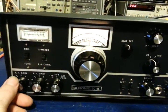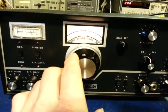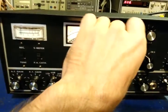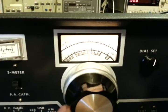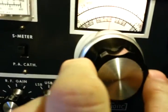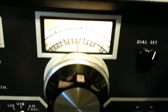You hear that? Hard to hear, but there's what they call null. You have a tone — goes down, comes up. So let's say your dial wasn't calibrated. See how far it is off the dial there? So what you do is you set your dial, get the camera lined up here, so it's reading dead on Channel 19.